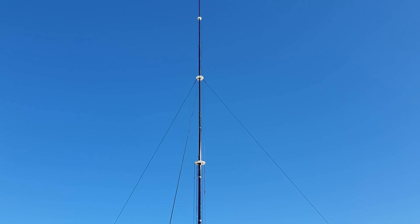In terms of SWR I'm going to be really comfortable, and it's also going to help with the next topic: 30 meters and 10 meters. At the moment, 30 meters is 10.1 MHz — technically that will resonate on three times that frequency as a three-quarter wave, which would be 30.3 MHz, and in reality it's a little bit higher, say 30.5. On the Classic we have a 40-meter element that we fold back, and what happens is 15 meters comes down from 21.6 to 21 MHz — we lose about half a megahertz — and it doesn't affect 40 meters.